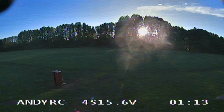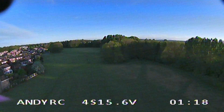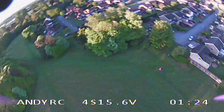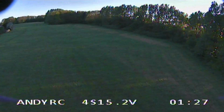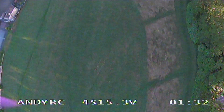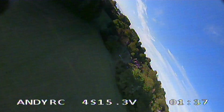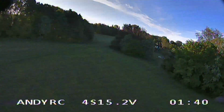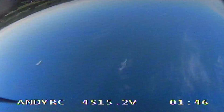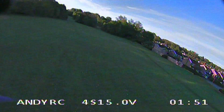So this is a flight that I did very early in the morning, because it's the only time that it wasn't raining. So the sun is very low on the horizon. It was about 6 AM here, and I'm using the Eachine VRD2 goggles to record this, because it's an HD recorder, records in 16:9, and something that was interesting is if you turn diversity off, then the antennas don't switch and then you don't get any dropped frames. So I found that to be better, really, when it came to the DVR, and the reception's pretty good as well.